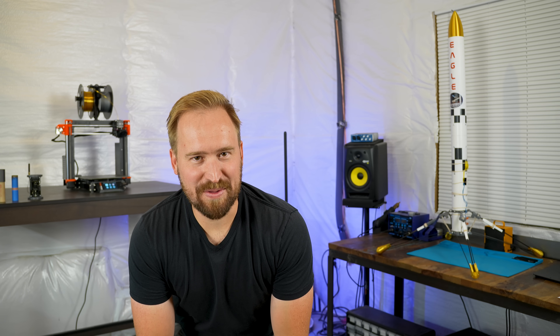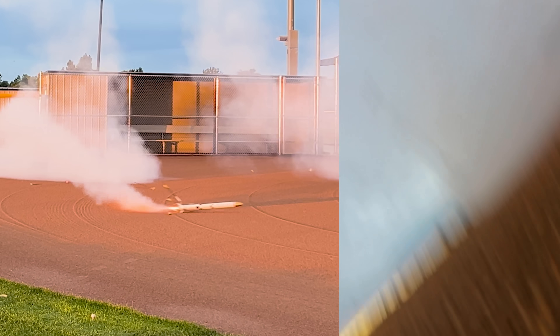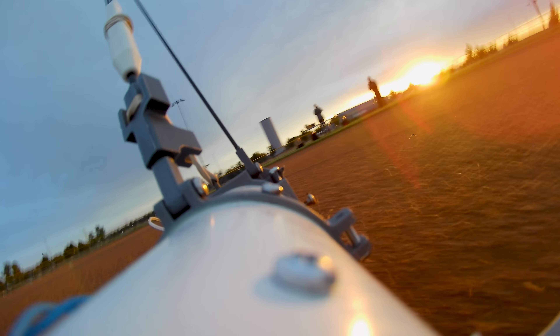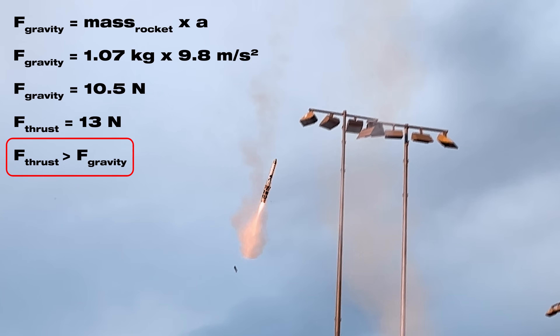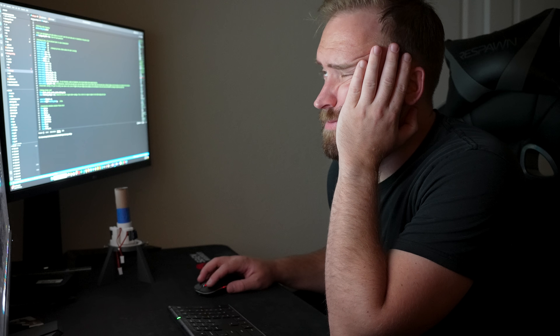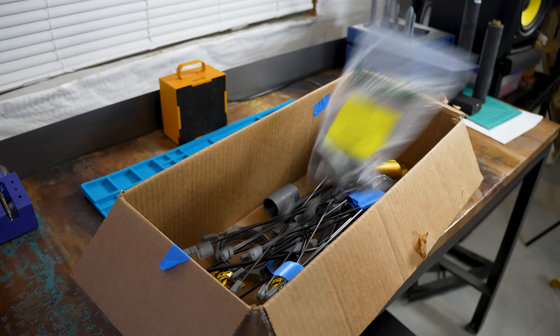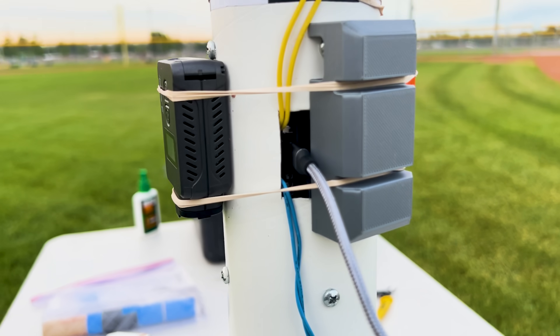So that was my fault. The night before the flight, I had added some code to make Eagle wait to ignite the second motor, so that the rocket would hit the ground a little bit early. The theory was, if we hit early, then the legs would absorb the shock well enough, and then the motor would be too weak to push the rocket back into the air. Had I spent just a little bit of time analyzing the physics behind this idea, I would have learned that it was not the way to go, because that motor had plenty of power to cause a second takeoff. Moral of the story: don't make major changes just hours away from launch time. Luckily, since I've crashed a lot of these rockets, I learned a long time ago to come with extra parts. So I repaired the legs, and re-uploaded the flight software without that offset this time, and hoped Flight 2 would be better.